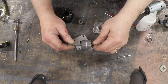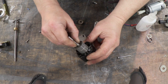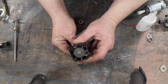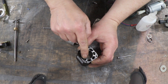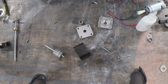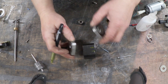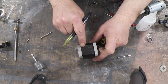So here's the rotor back together — I just drifted it back on minus its bearings — and here is the centerpiece with the coil missing. Those are incredibly tight tolerances, which is really cool because that's what we're looking for. You can see how tight those tolerances are. Now we've got these channels down here; we need to join those channels to the outside. So we get something to mark where those channels are, bolt the end plates back together to stop them spreading, and drill little holes along those marks.